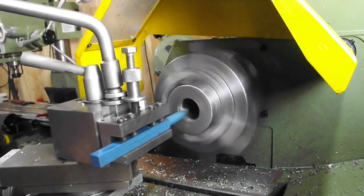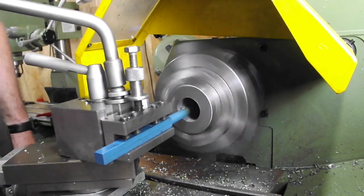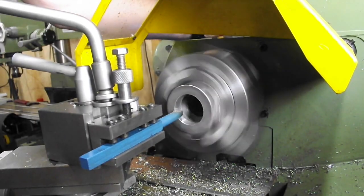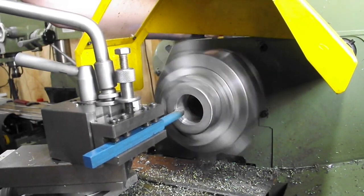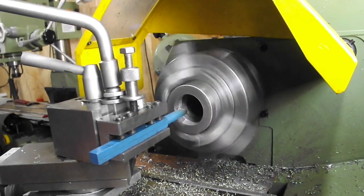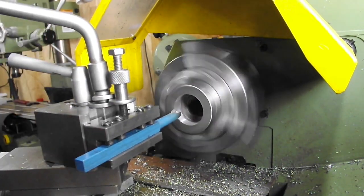Because the bore is going to be one and a half inches I had to invert the jaws to prevent colliding with them when machining. I used a bit of 2-inch aluminium pipe, 10mm long — this allowed me to pass through the material safely. I could also put a lead chamfer on both sides of the finished bore before threading it.